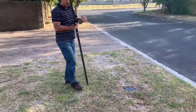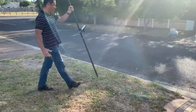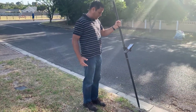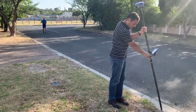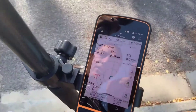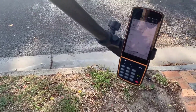Now I'm going into a tilt scenario — the pole is not plumb — and I'm going to walk back towards the point. There's the first indicator telling us we're within half a meter of the point. As I get close, you can see the point is fairly close to the spot. Now I'm on it and tilted, and the accuracy in this tilted state is currently two centimeters.